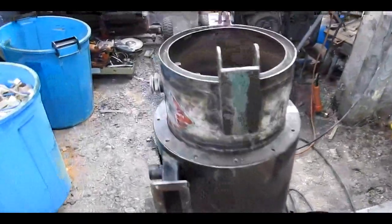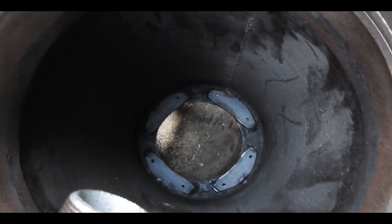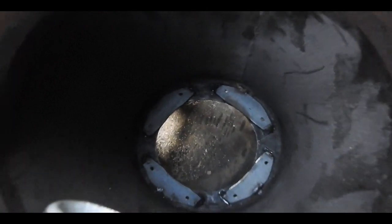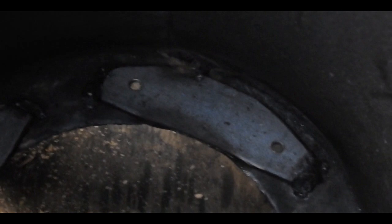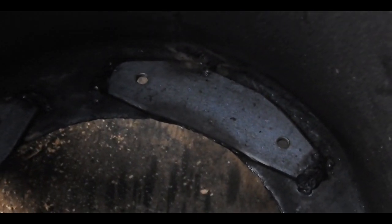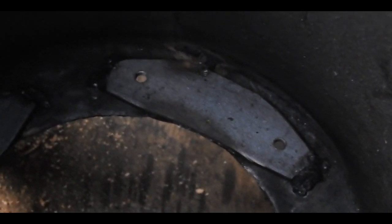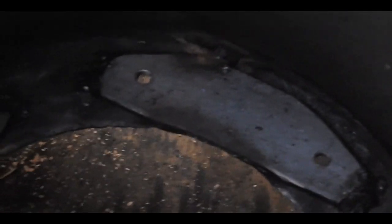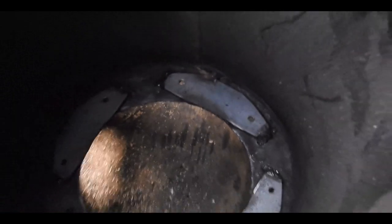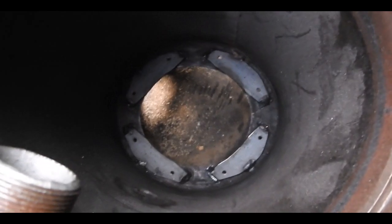At the bottom of this gasifier crater, I have the retainer ring that allows the reactor assembly to be housed. You'll see these steel plates here — what's not obvious is that they've been drilled and tapped to accept stainless steel bolts, five-sixteenths of an inch, or eight millimeters. That allows me with these eight bolts to secure that large disc, thereby holding the entire assembly in place on the floor of the gasifier.